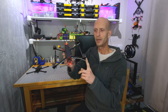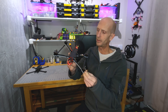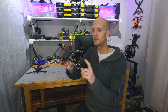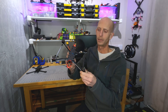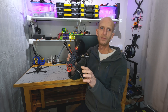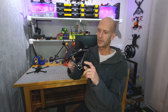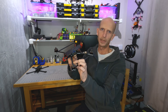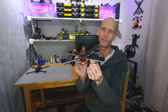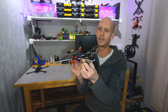A little bit more about the arms now. I wanted to use foam core to lower the weight down a little bit, and I figured that foam core for the arms is going to be okay because these arms don't really go through any torsional stresses because of the side braces. So the arms in vibration don't really twist at all — the side braces almost entirely negate that. When vibrating, the strength of the arm is only really being stressed in an up and down motion, which is the perfect scenario for using foam core carbon fiber. The portions that undergo the most stress are the outermost layers, so the top and bottom are the parts put under tension and compression when the arm tries to bend.